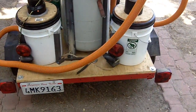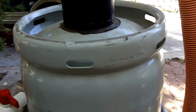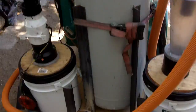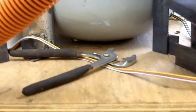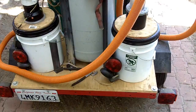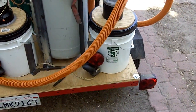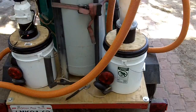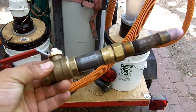First and foremost, this big thing in the middle is just a standard propane tank — cost me about a hundred and forty dollars at my local big box home improvement store. It is turned upside down, so what would normally be the top is now the bottom. We actually sawed a hole through the trailer and the top sticks below. There is a one-inch orifice on the bottom, and we put together a nozzle because this is an updraft charcoal gasifier, not a downdraft Imbert-style gasifier.